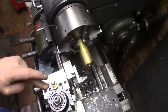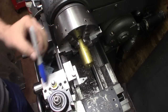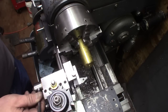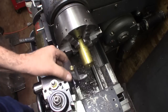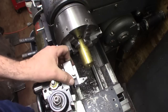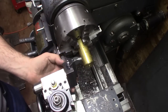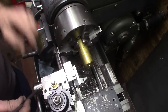I have it mounted in an AXA tool holder and you can see how the length here is just about as long as my tool holder. There would be plenty of room to have your handle out here clearing the tool holder and the tool post as you rotate, because you're going to be rotating approximately 180 degrees — front to back over the top of your workpiece to form the ball. So I'm going to take this boss and mount it in here at an angle.